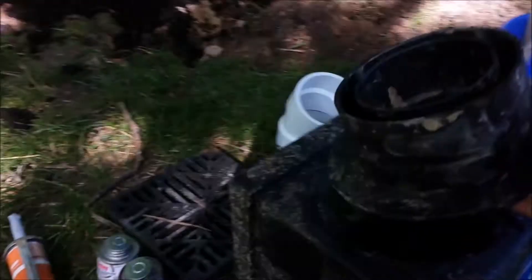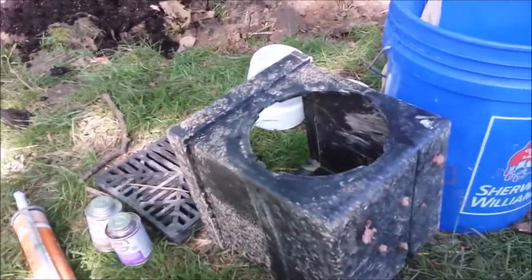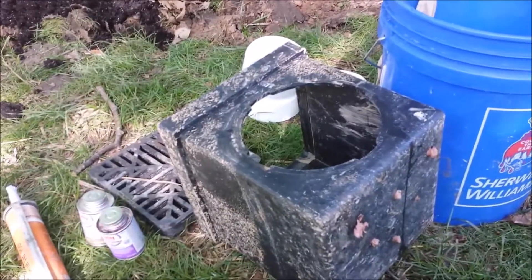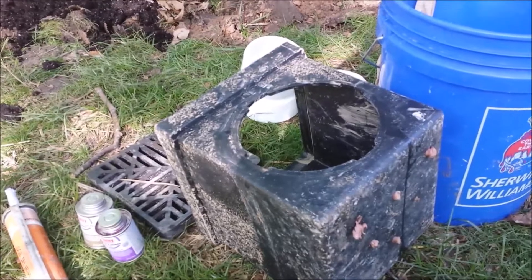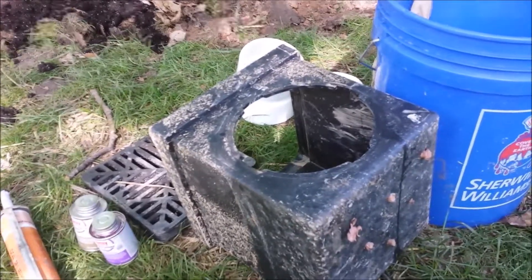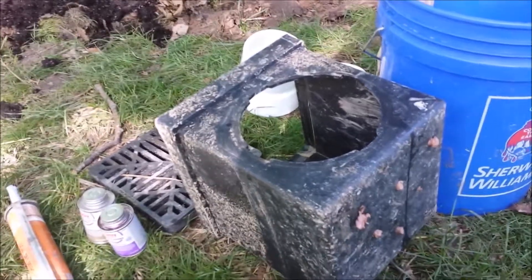These have locking caps on both sides with knockouts to size — you use a four-inch or three-inch size. I'm actually using schedule 40 PVC because I don't want any problems with clogs. If I have to, I can always run a rooter through it and clean it out, but I don't think that'd ever be a problem.